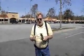This is David Rockey, N4WQF, and this is a TDOA antenna that I built. I got the board from Far Circuits, and the parts are just standard parts you can buy at any parts store. The idea of this antenna is to measure the time at which the signal reaches each antenna, and when it reaches them at the exact same time, it'll be quiet on your radio.